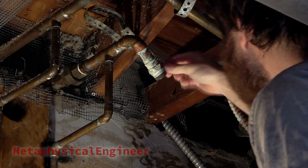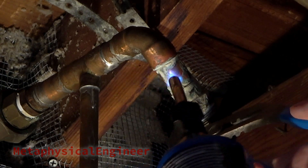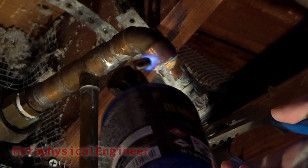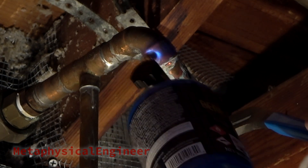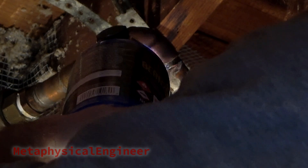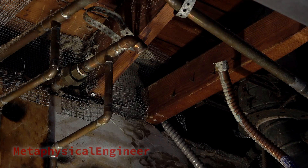Double checking there's no flammable dust up here — not so much a fire hazard as a distracting stench hazard. This little propane utility torch is undersized, and the remaining calcium deposits essentially locked the joint together. A small amount of residual water also stole some heat from the joint until it boiled off. Even when I saw a little bit of solder dripping out, I really had to crank on it with the channel locks to get it loose. Pro tip: do not drop the torch. That said, there is no damage except to my pride.